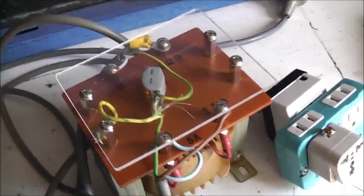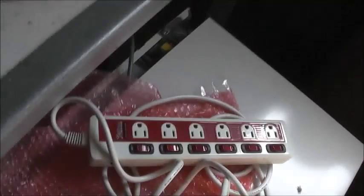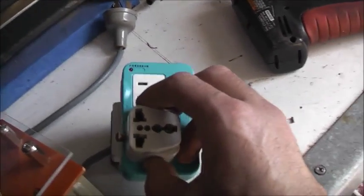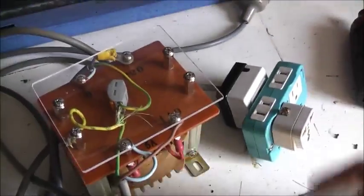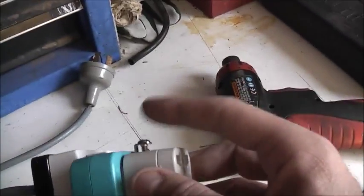Anyway, I'm going to put a 5 amp fuse or circuit breaker in this thing for protection. And I'm going to just plug this into it and use it for small loads like whenever I get 110 volt only. Use it on here. I can plug Australian appliances into that. Dual rated or dual voltage rated stuff. Appliances that are 110/240 volt dual voltage compatible will plug in there on a little adapter, and I can earth it manually. Seems to be pretty common in Taiwan with appliances.